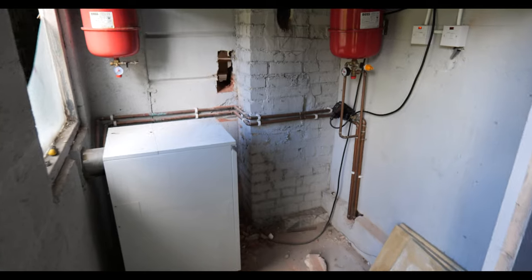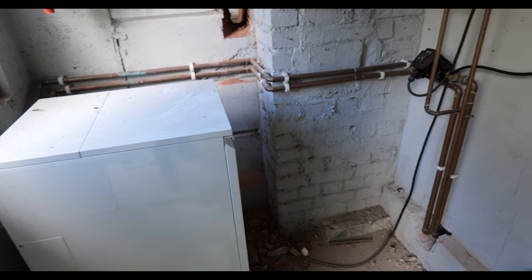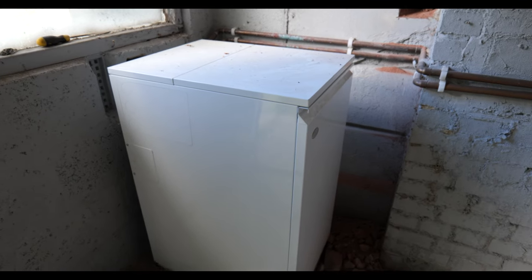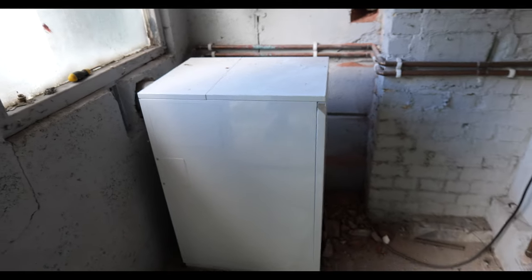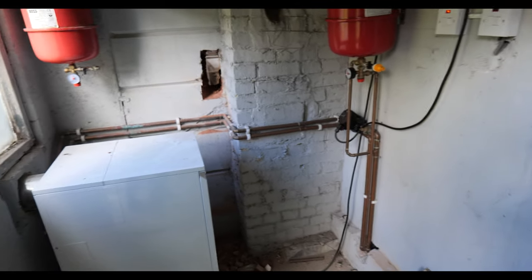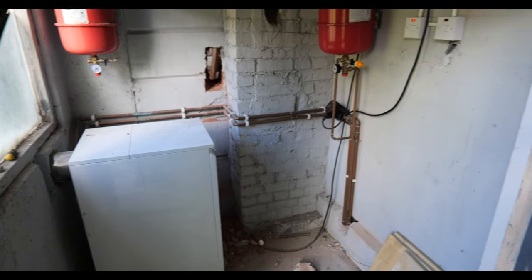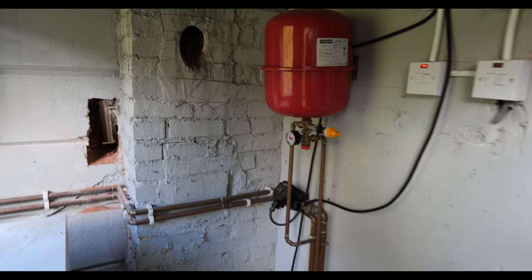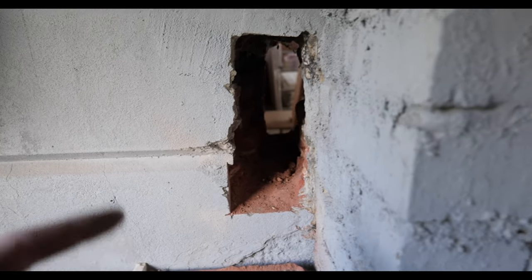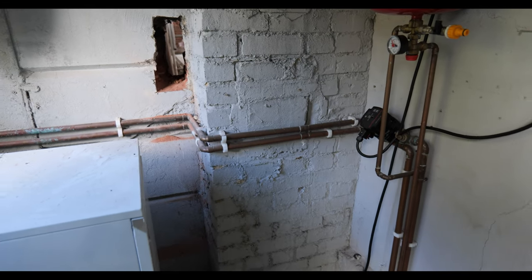This is the existing boiler room of the chapel. This oil boiler was originally temporarily plumbed in just to provide heating and hot water for the client currently living on site. We're going to be keeping this room as the main boiler room, reusing this Grant Vortex boiler on the left and moving it along slightly. The customer has also provided us with two 200-litre unvented cylinders which we'll be plumbing in on the right. We're incorporating a low loss header because we've got underfloor heating in several zones as well as a hot water return. We're hoping to get it all on Unistrut and make a nice job of it. Unusually, we're actually going to do the boiler room last.